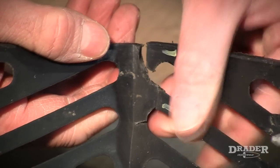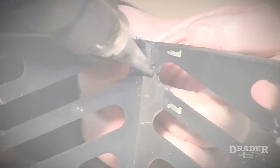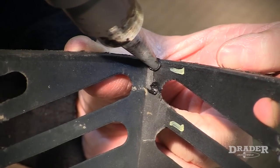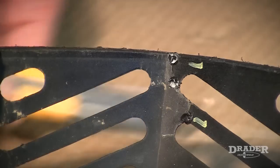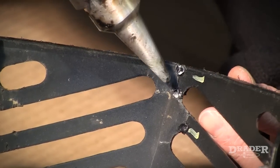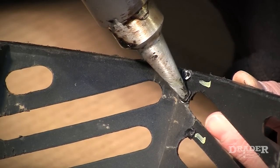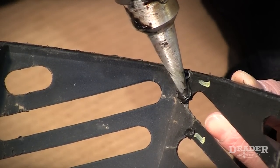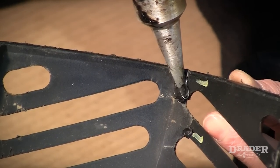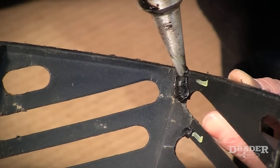Now I'm going to take these grill fingers and actually weld them into place. I'm just going to spot weld this one first. I'm just going to trim off these spot welds a little bit to make my next pass easier. Now I'm ready to weld all the way through there. I've really slowed down the welder in order to get a real deep melt into the polypropylene. And now I'll do the other rib.